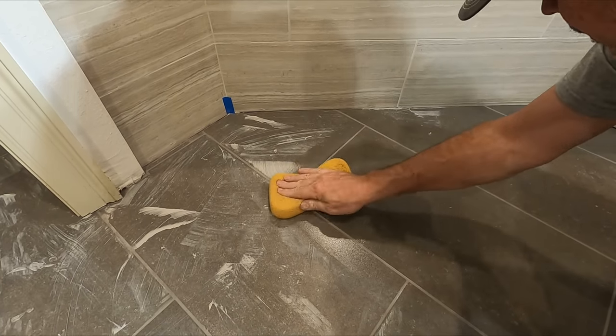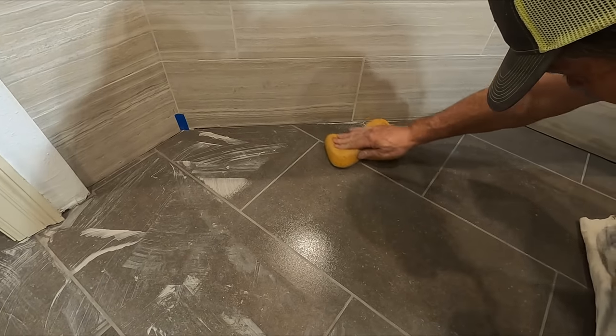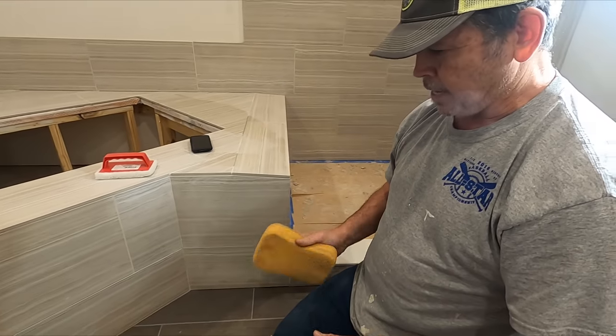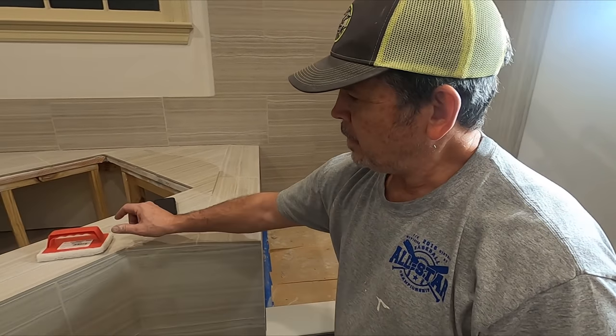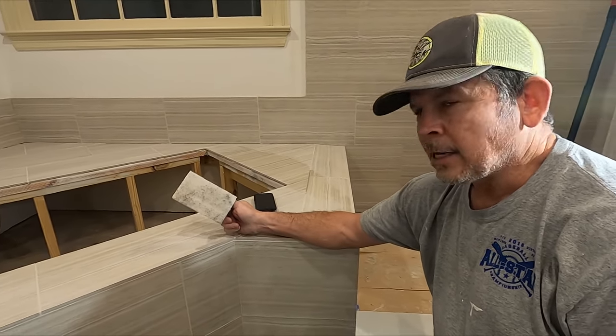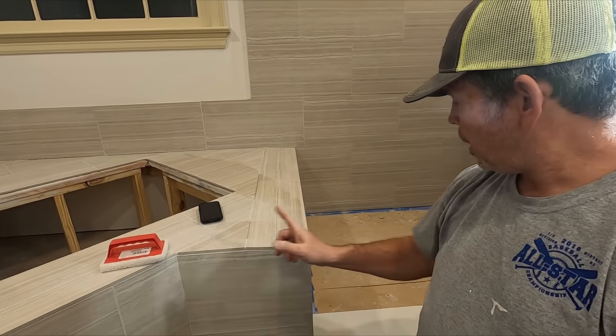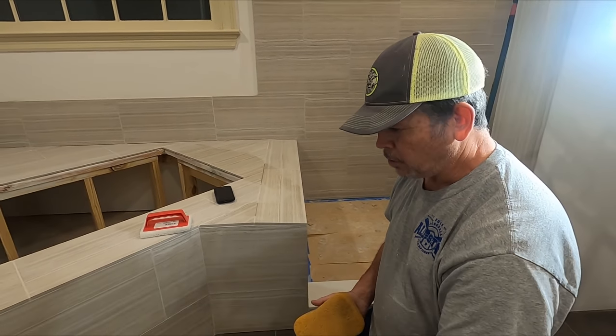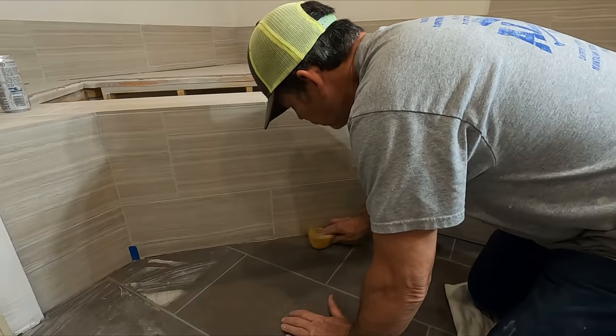You know, I think I like the sponge better. I have a little more control, and it leaves the grout line looking great. It's almost buffing the grout line. Yep. These work really well on like glazed subway tile, and it worked awesome in the shower. You saw us do that. But we think a sponge is probably better on these large tiles. Just seem to have more control.